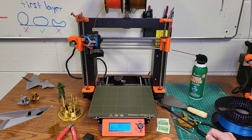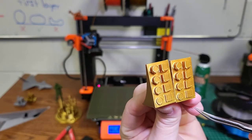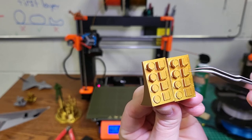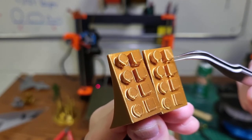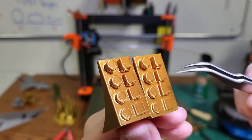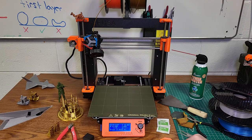I also want to quickly show you a test piece I made for testing different overhangs without supports. I printed an object with a 0.2 mm and 0.15 mm layer height and extruded pegs sticking out 1, 2, 3, and 4 millimeters. With a 4 mm peg and no support, the bottom really starts to have poor quality — the plastic was drooping down in both layer heights. Same kind of thing for 3 mm sticking out, but 2 mm and 1 mm extrusions with no support actually printed fairly decently. That's why I can print my octoprism with letters sticking out 2 mm fairly confidently.